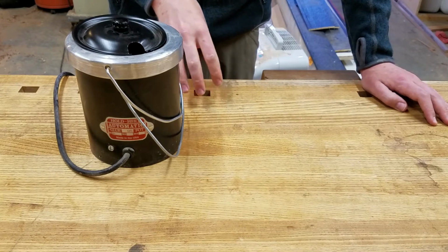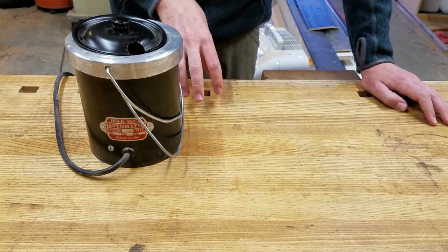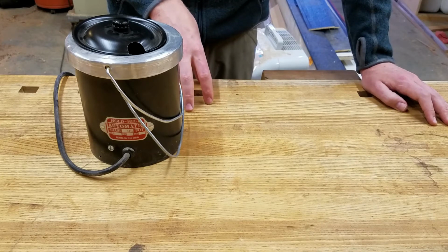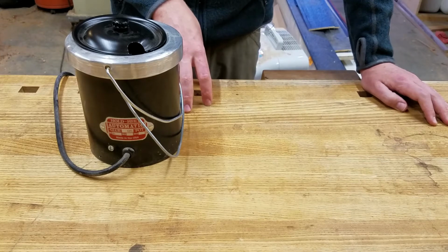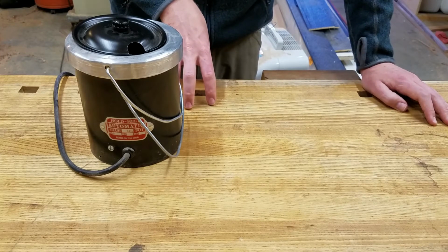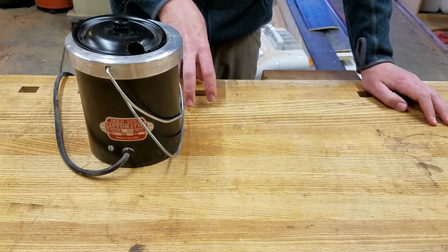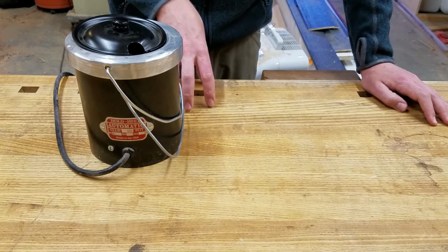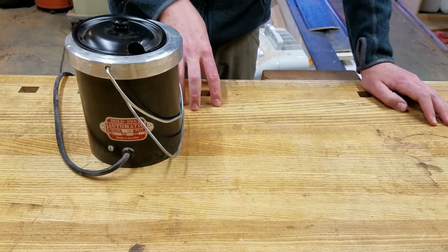This includes the ambient humidity. Provided you don't go below around 10% relative humidity, the hide glue will hold. If you go below that, it does become too brittle and is likely to release from what it's holding. That said, the number of spaces that go below 10% relative humidity are very, very few.